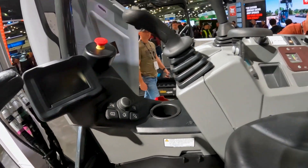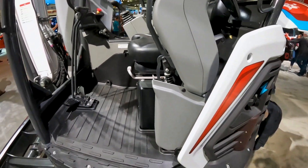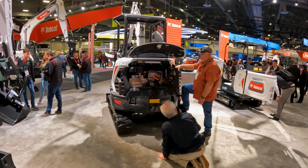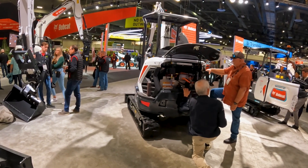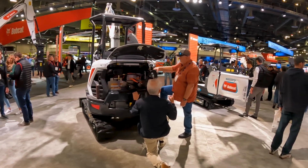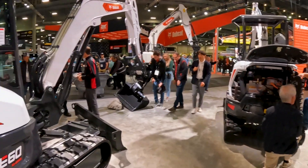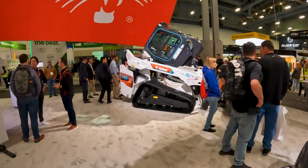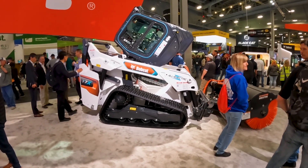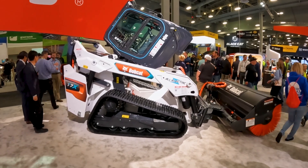The controls on the electric excavator are very similar to the diesel version — still the five-and-a-half-inch display, the same jog shuttle system, just a different battery meter on top and a key ignition switch. As for run time, I don't have a precise answer — it's all subjective. It depends on what kind of work you're doing, how much traveling, how much turning, how deep, how hard the material is. A lot of people have a problem with only four hours of run time, but running at full load — basically 100% capacity — they get about two and a half hours.